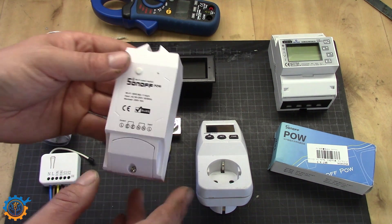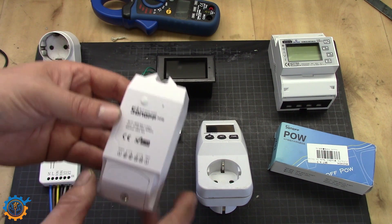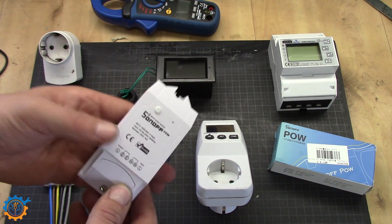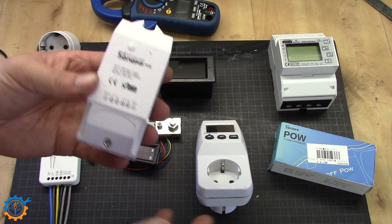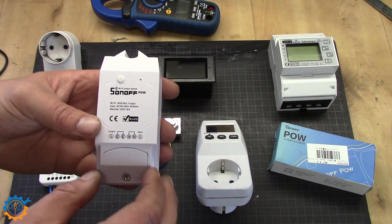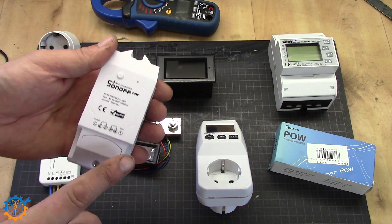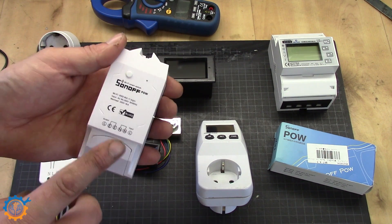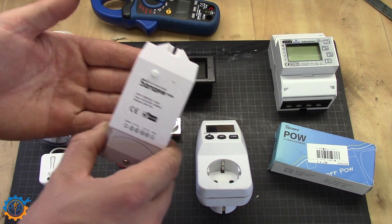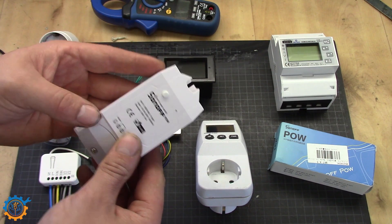This one can also hook up a temperature sensor or other peripherals. Inside, it is driven by an ESP8266 microcontroller, so you can flash it with your own firmware. In my house I use them a lot with MQTT, hooked up to my wireless network, feeding data to my Raspberry Pi. Videos will come about how to hook it up to my Raspberry Pi Grafana image.